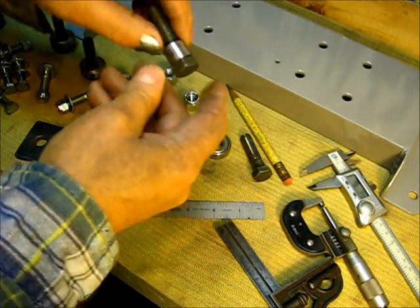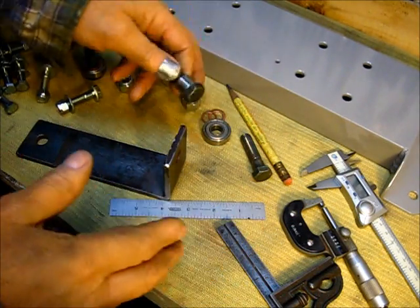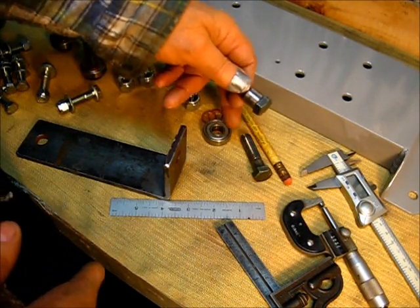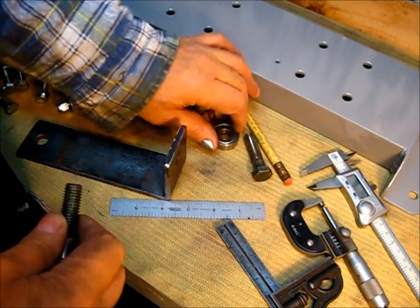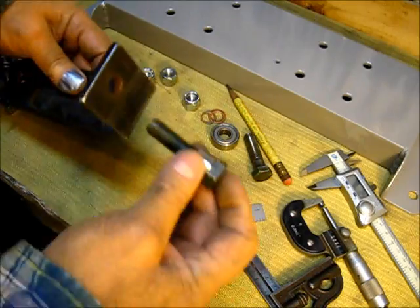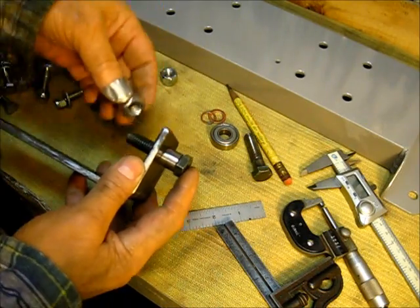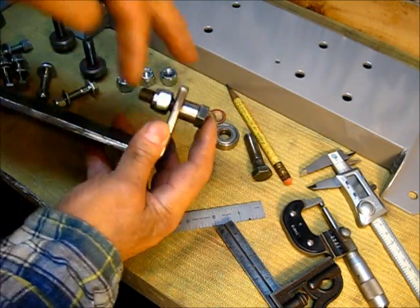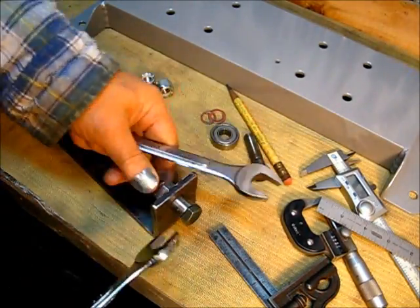We're going to put this pipe spacer right here. We don't want the bearing exposed — this is a sealed bearing, but even so, we do not want it in an environment where it'll get dust, dirt, and shavings in there. Just standard practice — we want to protect that bearing at all cost, keep it away from the work area. So I cut this piece of pipe as a filler, put it right in here, and use the lock washers. You just put that right on there and tighten it up.